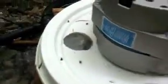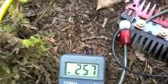We're at zero now. I'm going to open the valve about a quarter of the way. The Pelton wheel has started to turn — we're making electricity. We've got 25.6 volts, 26 volts. That's probably about half the capacity or half the power that I've been able to generate. Now I've turned it on full — higher water flow. Now we're producing 57 volts.